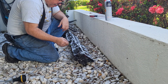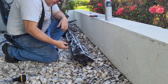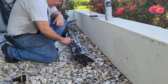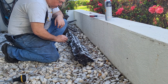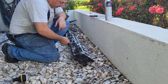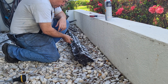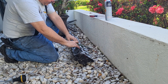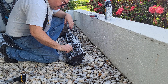I haven't been able to find my epoxy. If not I'll have to do it at DVS because it's running late already, and today's Sunday — we want to be on the road early Monday. So I may not have a chance to epoxy them here. In any case, they need to be cleaned before you epoxy. Any time you use an epoxy the area has to be super clean — no grease, no oil, no dirt — because dirt is not going to add to its adhesion.